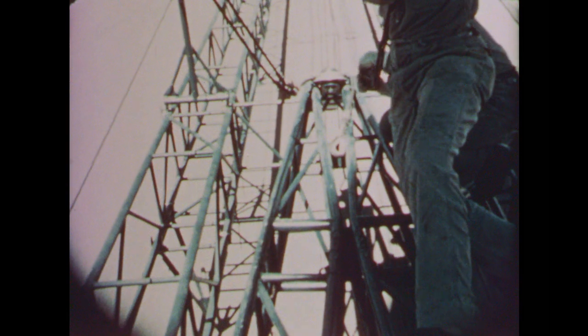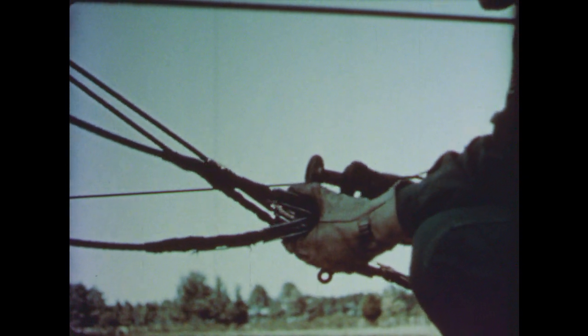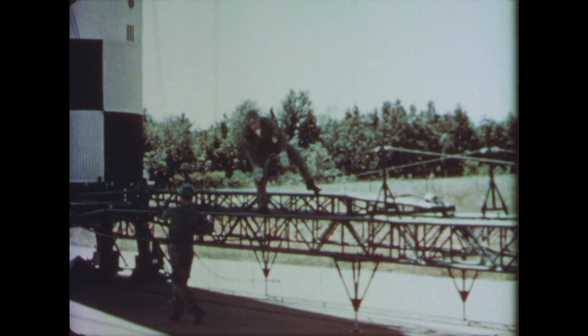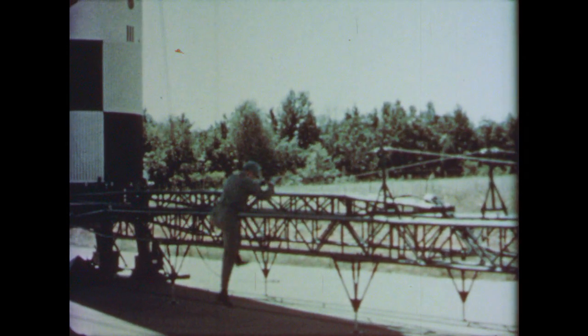These slings are first detached from the equalizer wire rope at the top section of the A-frame. Then the shackles are repinned to prevent loss. Each erecting sling is free at the lower end. The opposite end of each sling is suspended from the erecting bolt on the thrust unit. A small release cable is part of the sling assembly.